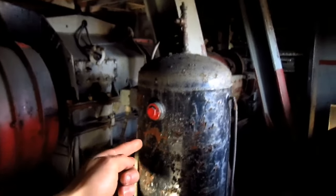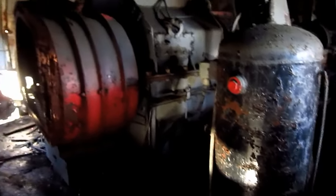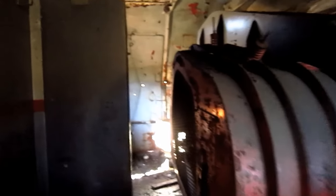Right here you can see the main air tank. Inside the cabinet mounted on the left side of this machine is where the master controllers were located, which control the output of the magnetic amplifiers, which operated under static control for smooth response. These varied the intensity and direction of the exciting current, which establishes the voltage for the main generators. As you can see, a lot of this equipment, such as the controllers, have been removed over time.